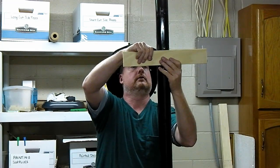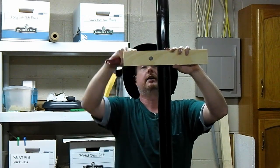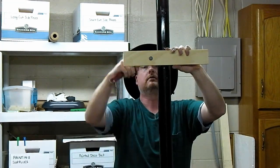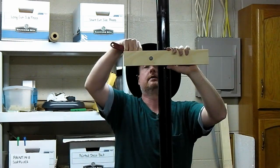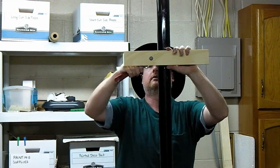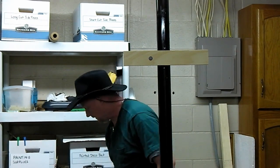Level that and get it like you want it. Then when you tighten the nut down, what you want to do is tighten it so it pulls the head of the carriage bolt into the plywood. It's okay if it digs into it — that's what you want. It'll make it nice and tight and will minimize the protrusion as well, because your bat house is going to be hanging against that. As a result, the bat house won't sit up perfectly flush to it, but that's fine.